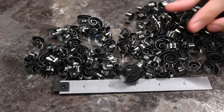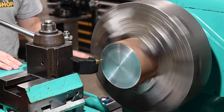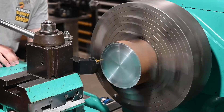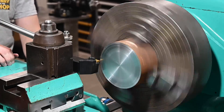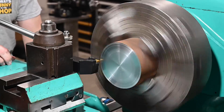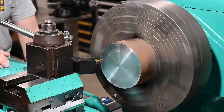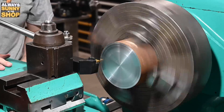Let's go over to the lathe and see about cutting some big chips. Here's the setup on the machine: we are going 227 RPM, and I've got a CNMG 433 insert — I believe this is a Sumitomo that I got from Mr. Dedman, so I appreciate that. I keep meaning to order some heavy steel inserts for stuff like this. What we're going to try first is that 200 thou depth of cut, so I've got my indicator set here.